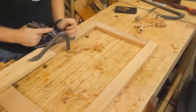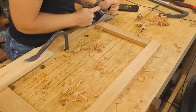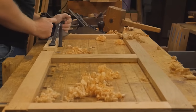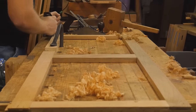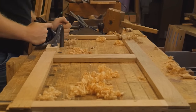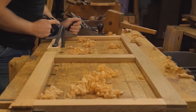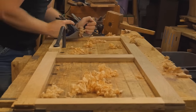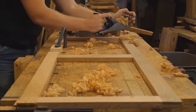I made them a little bit fat so that I could smooth out all the joints and make everything really nice and clean. I slowly went through the process of shaving them down to thickness, smoothing out the joints, and making sure everything is nice and flat so that the drawers will slide nicely along them. This was a little bit tricky as the joints — the grain — turns 90 degrees suddenly, so you have to kind of skew the plane so that it works in both directions of the grain.